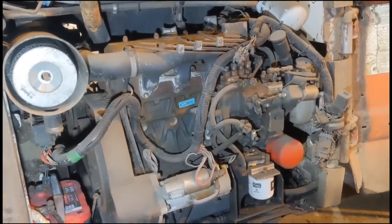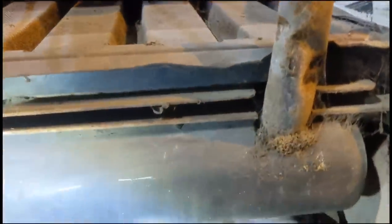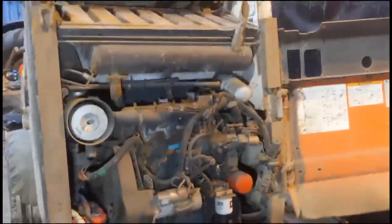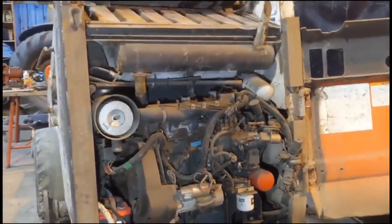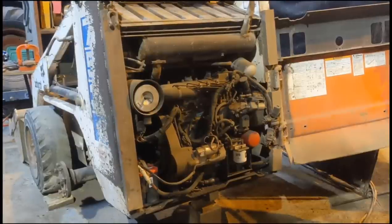Hope she goes. So stay tuned for cobwebs and flipping spiders and water and everything blowing out of the exhaust here if it starts. As I said, we didn't have any luck in the past, don't know why, but we'll try again. As little Easy Start as possible, because if you use too much, it ignites in the cylinder with an extremely aggressive bang. You can bend rods and break rings and everything nasty, so I'm going to use it as sparingly as possible.